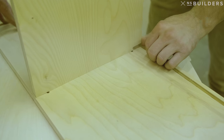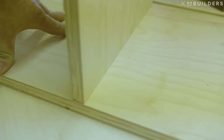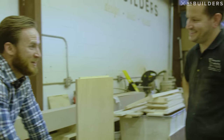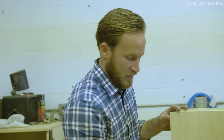That tenon slips in, gives it a solid connection. We're not gluing it because of the box getting racked — that's our main concern. If we glue it and it's slightly racked and you go to put the face frame on, you're cracking face frames or it's not sitting against the wall tight. The system's been working well so far. My favorite thing about it is you have that positive placement — when this goes in, you're not messing with it back and forth, and you're simply adding the screws where possible.